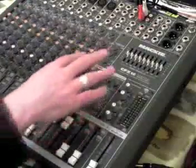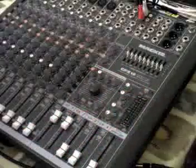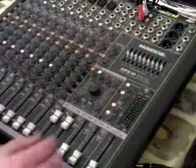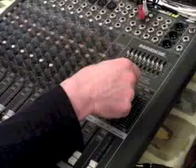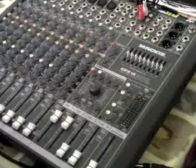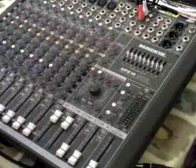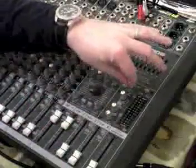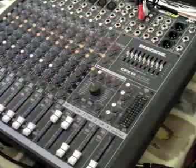I'll leave the effects section here just for one moment and talk about this metering section here, and some of the master volume things or master level things for various features of the desk. So starting at the top here, you've got your overall return level for EFX1, the EFX1 send. If you remember, that's where we send little bits of each channel out of the desk via the master send here and through the effects processor, and then back into the desk, into the main mix via this effects return. So that affects the level of the return signal back into the desk from the external effects unit.